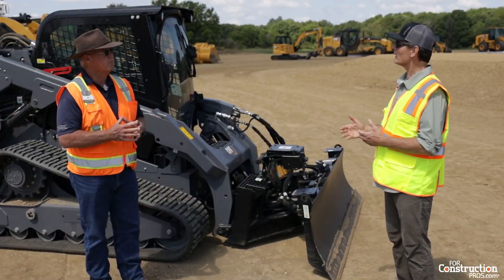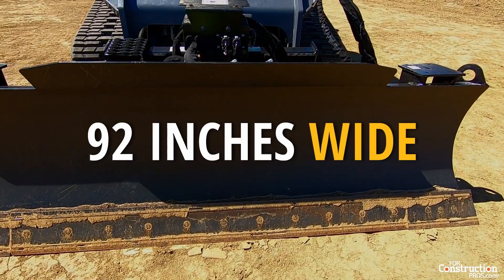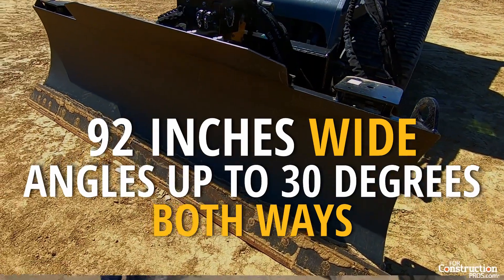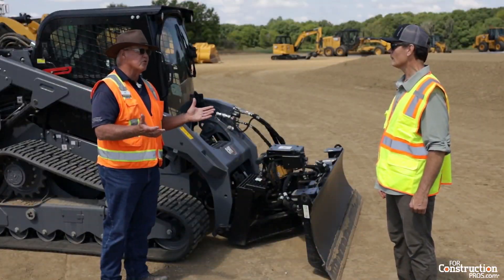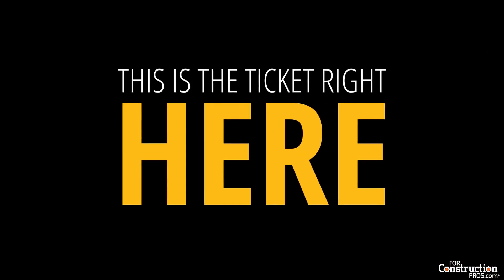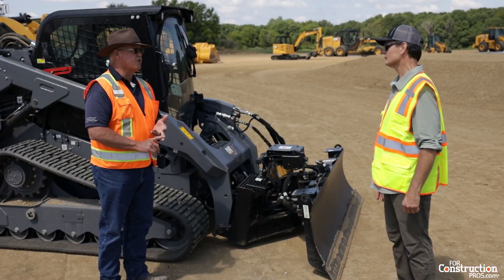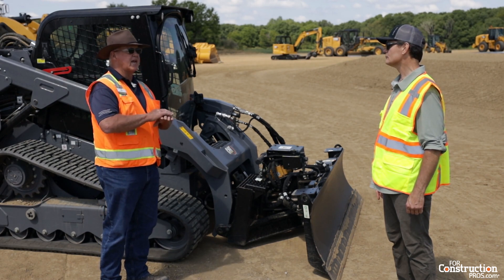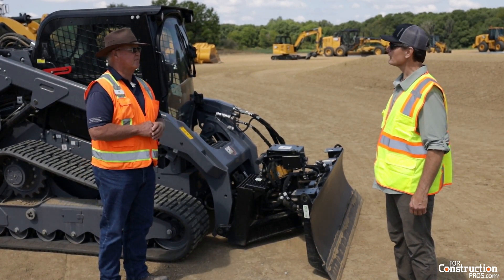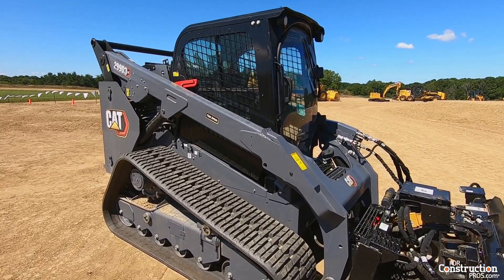For grubbing and clearing, take a look at the blade itself — it's 92 inches wide, angles up to 30 degrees both ways, and gives you a 10 degree tilt. It is patterned after the VPAT blade running on Caterpillar's small tractors. In an area where you're doing land clearing or pushing heavy dirt and soil, this is the ticket. It's got a lot of endurance, replaceable cutting edges, and it's very stable. But when you're doing finish passes grading out a building site or flat pad for a parking lot, you'll have a great finish product.